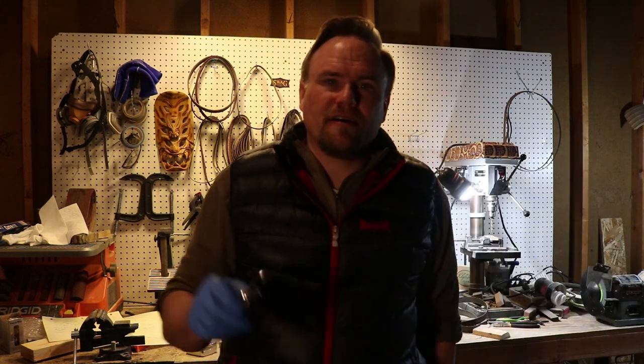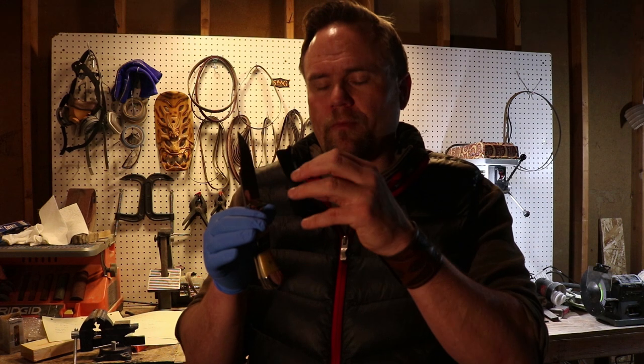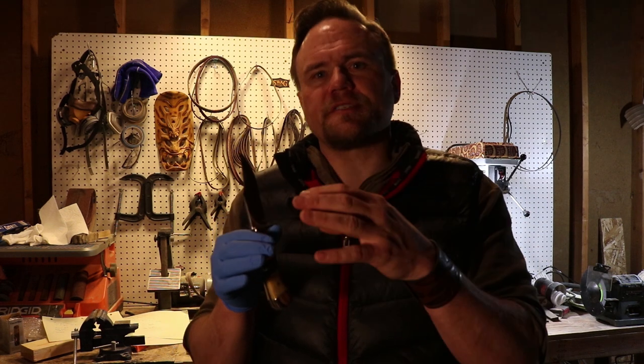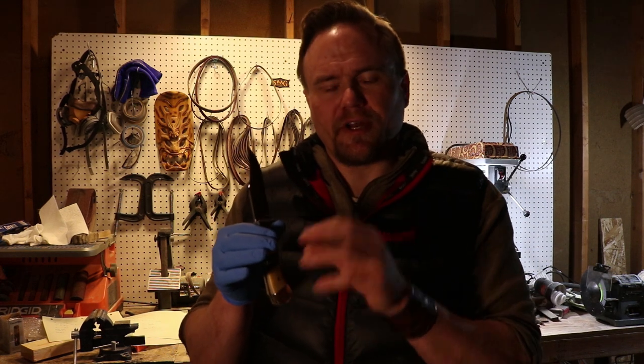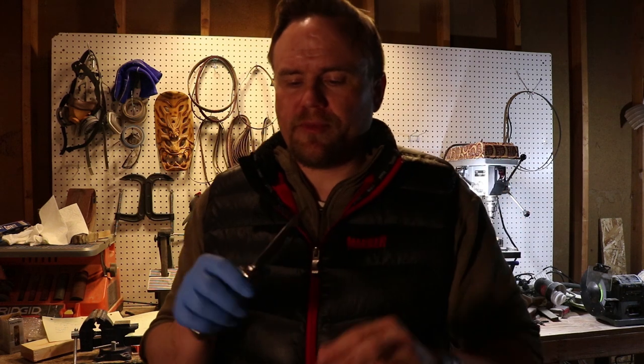Also at the end there, I used a combination of boiled linseed oil and mineral spirits. I was listening to Fedor Knives, follow him on Instagram, you should go check him out, he's awesome. But he was talking about for lighter woods, like this yellowheart, mineral spirits and some sort of oil. If you soak it in, it helps seep it into the wood, kind of stabilize it. It gives it a little bit darker hue. I did 5 coats of that, and then I did paste wax over the whole knife, and then wiped it off and shined it and buffed it again.